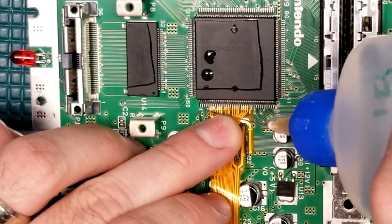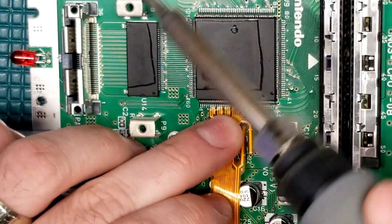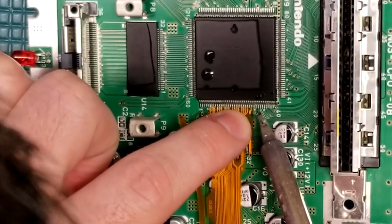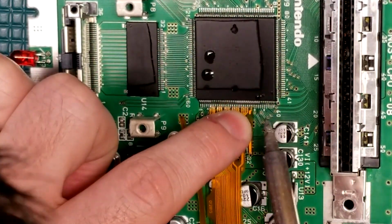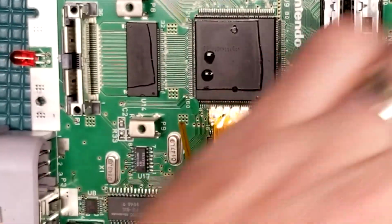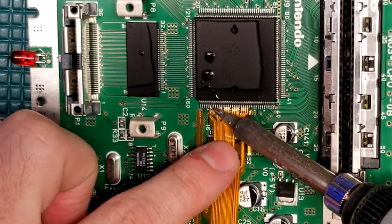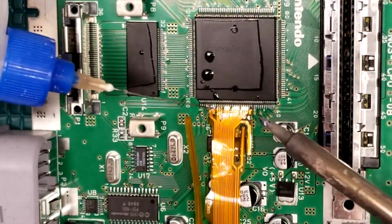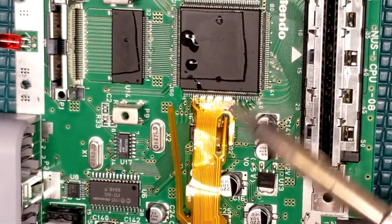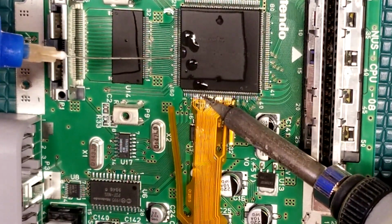I've zoomed way in for you guys here. It's a digital zoom, but I've zoomed way in to illustrate, and you'll see as I work my way through this, I used a little bit too much solder, and I'm going to have to go through and clean it up as I go. If I were to do this again, I would definitely use a lot less solder and probably a little bit more flux, even though I'm continuously using no clean flux throughout the process. I would even use more, and like I said, I would use a little bit less solder on the tip of my iron. The good news is, once you knock this step out, the rest of the process is not too bad at all, as you will see.